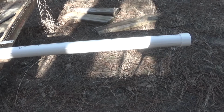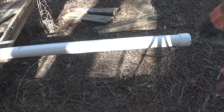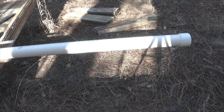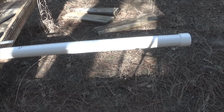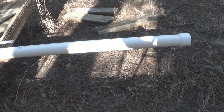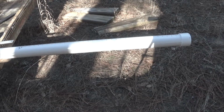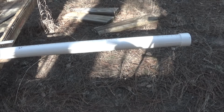What I'm going to do is start on this side over here, and I'm going to drill pilot holes using a 1/8 inch drill and work my way up to the top here. As soon as I get that done, then I'll come back and I'll bore with a larger hole. The reason for using a small drill, and I thought about using a 1/16, but they break too easy, is because this is a round surface, and this way it will dig in a little quicker and it'll give me that start pilot hole. Whereas a large drill has a larger point on it and they tend to flex. And I'm not using a drill press, I'm hand drilling. So I'll show you this one line partially, and then I'll show you the completed project.